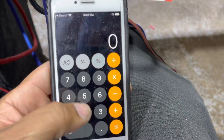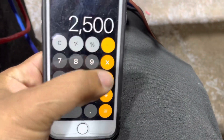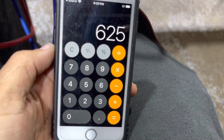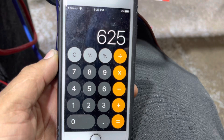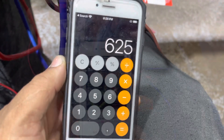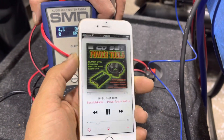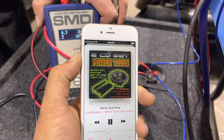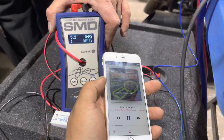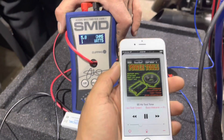If you do the math, it's 50 volts AC times 50 volts AC divided by a four ohm load. Just by AC voltage, the amplifier is doing 625 watts RMS, and that's at a 93–98 hertz test tone. As you can see, it did rated power — let's hit it again real quick.